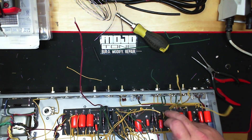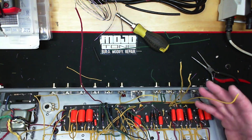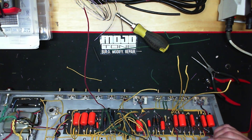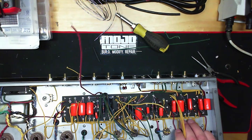Of course the exceptions are wiring that goes through the holes and terminates somewhere else on the board — but almost every amp does that. With these it's not a PCB amp, it's a hand-wired amp, so you can see exactly 99% of the time where the wire is going. So the normal channel is done. I need to go through and straighten out some of my wiring here — please don't be too critical of my wiring.